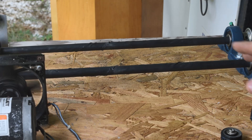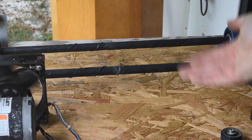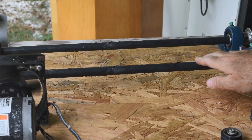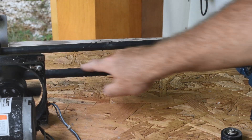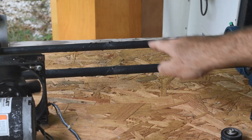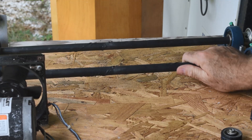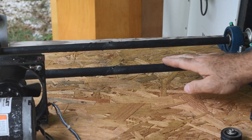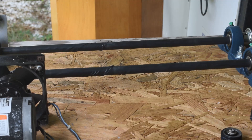I'm going to leave it on there for now because we still have really good traction between the steel shafts and the tumbler barrels. Running over the lumps gives a little extra agitation. What's going to happen over time is this will get more and more ragged, and I'll have to cut it off, take it apart, and put new heat shrink on — but in smaller sections instead of one long continuous piece down the whole shaft. I think the problem is we're applying more torque in some areas than others, causing it to twist. Smaller sections would probably solve that. Leave a comment if you're familiar with this issue and know how to resolve it.